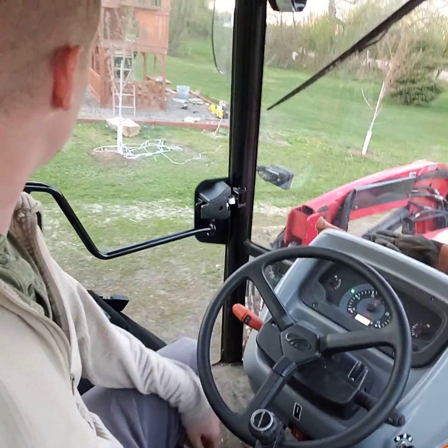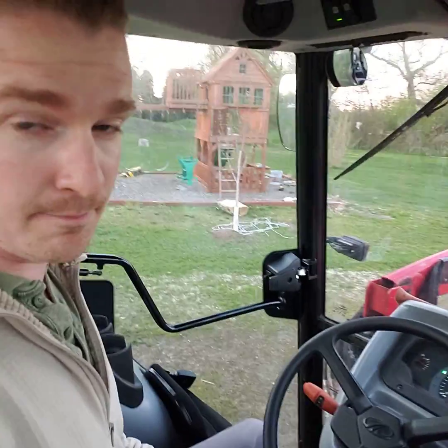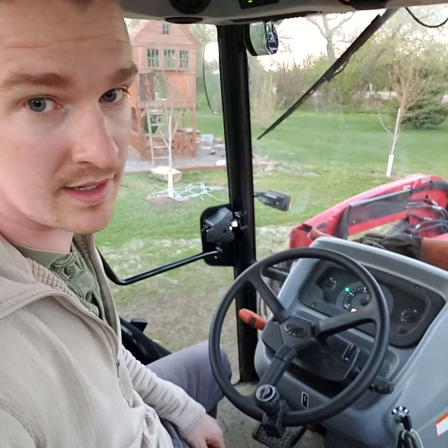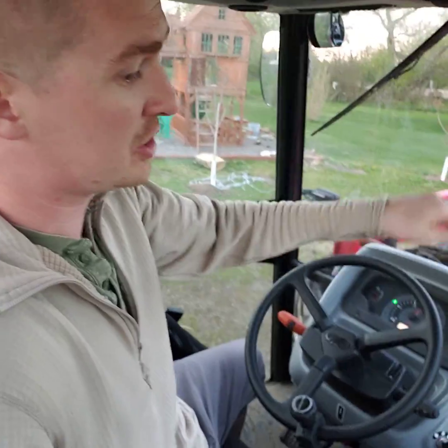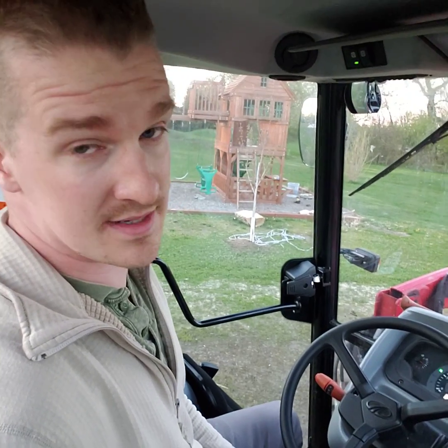I would not recommend doing that — it's hard on the equipment. Usually with the brake you get pretty good at just popping it out, smashing the brake, and putting it back in gear the way you want to go. It's really simple. The design was really new to me. The one thing it will do is lurch, especially on a tractor with this engine size and the gearing it has. If you're at a high RPM and too high of a gear and you put it forward or backward, you're going to get a jarring effect where it pulls you hard one way or the other, just because it has a lot of power.